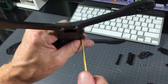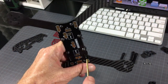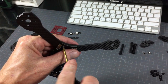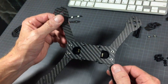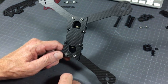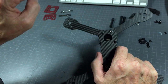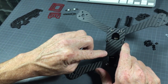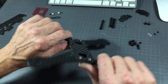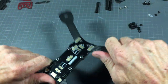You won't be able to strip the bolts with a two millimeter drive — you'll only strip the hole — so just tighten the tops. That's basically our center section, and it's super stiff and obviously super strong. In an impact the pressure on these bolts is very minimal because the force on one bolt has to transfer to the next bolt and the next, so all of them are affected. For one arm to move one way or another, all bolts would have to give — so it won't move. It will break maybe, but it won't move. It's super super stiff.